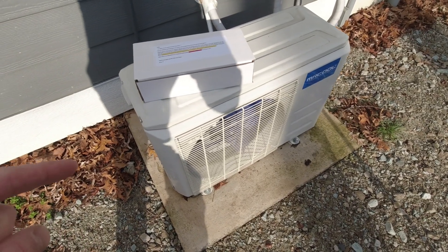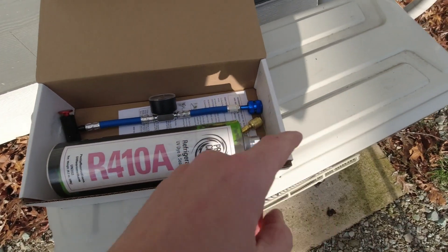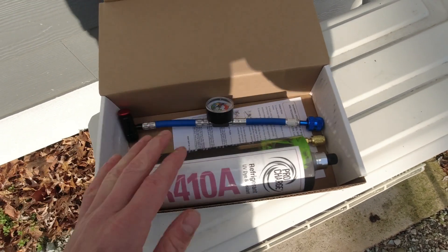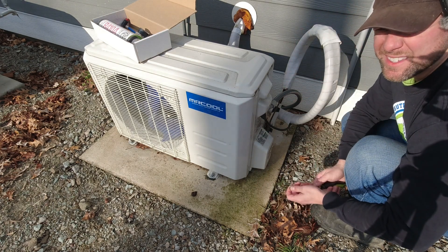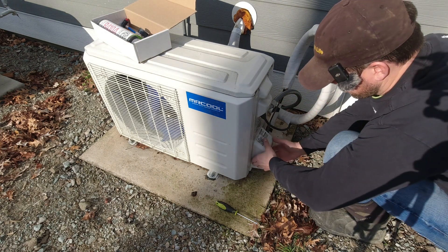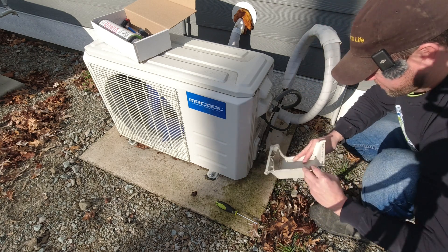I found this repair via YouTube, so got to give credit where credit's due — I'll link his video below and a link where you can purchase his kits. The kit includes R410A refrigerant and a hose with an adapter that has a gauge on it so you can make sure you're in the right zone. You have to make sure your unit uses R410A refrigerant, and over on the side of the unit you can confirm that. I'm not going to be overly detailed here — this is kind of a do-as-I-say-not-as-I-do, at-your-own-risk scenario. His video had thousands of views and lots of comments from people saying it worked fine. This does work on Mr. Cool units, and as long as you can get your line set hooked up properly there should be no issues.